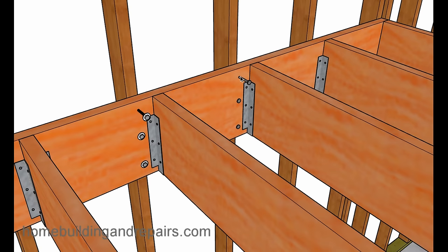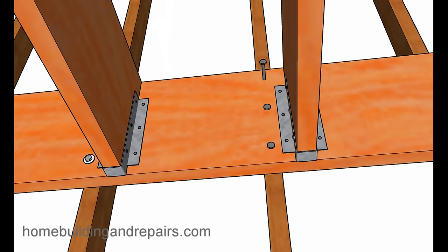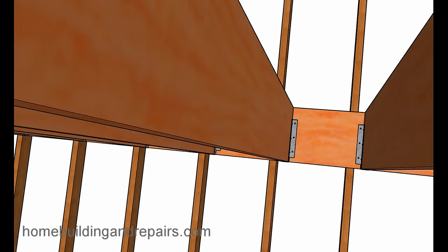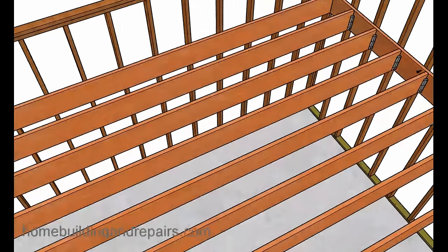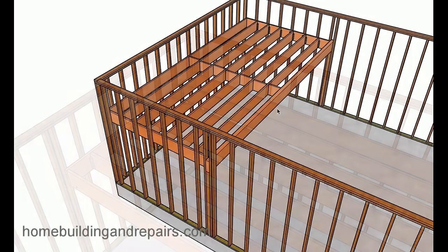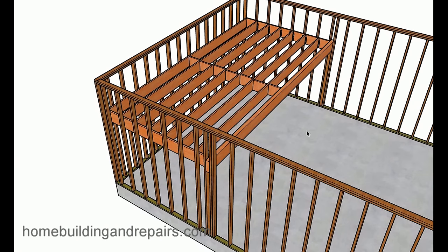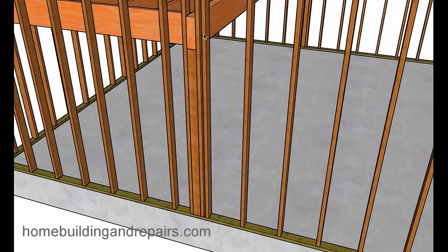Three or four nails might be required for each stud. This drawing here has a single joist on the end. The next one will have a larger joist — you can actually use a double joist here or a beam. Here's the beam I'm talking about. It's not uncommon to have something like this at the edge of a floor, and this would give you more strength, especially if you were going to use it to connect a stairway. This one will have a post underneath — that four by four, or if you're going to use a four by twelve beam, something like that.